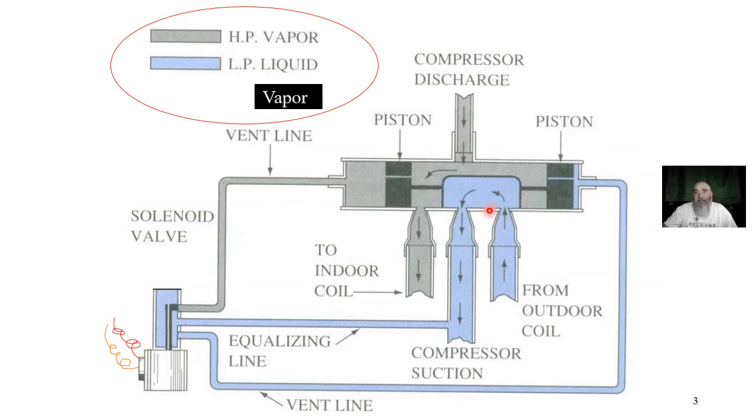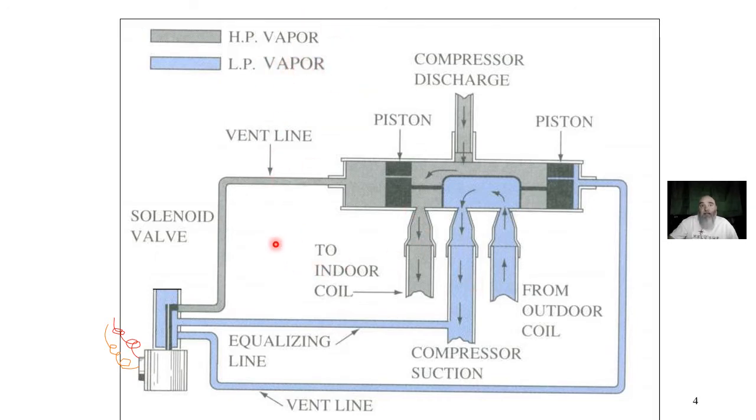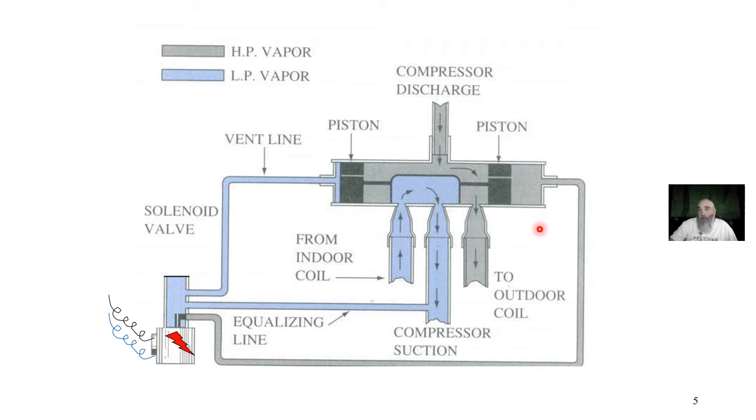They're showing low pressure liquid as the suction gas in this four-way valve, which is kind of crazy. Moving forward, I'll show how I repaired it. This is the one I use to explain the function of a reversing valve. It's really nothing more than low pressure on one side of the valve allowed to exist through the solenoid and the tubing attached to it, and then high pressure takes over low pressure — that's what makes the slide move. Conversely, when making air conditioning, now we're making heat with hot gas going to the indoor coil. Low pressure is over here, high pressure overtakes it. What causes the valve to actually shift is a pressure differential — pretty straightforward. I never found a better diagram.